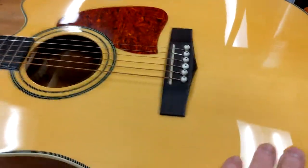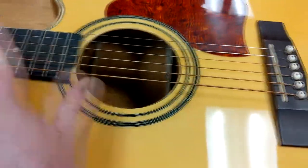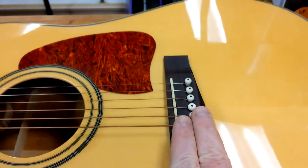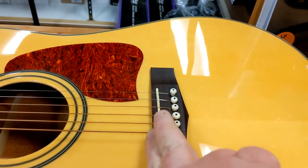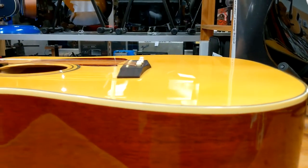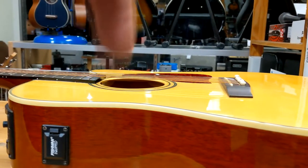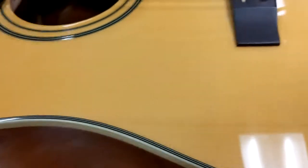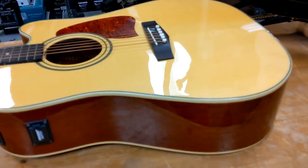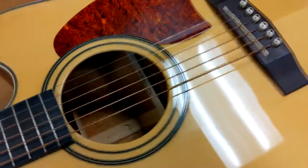So we're going to talk about top distortion. There's that hole I was talking about — it really wants to pull itself into the hole. What happens is you get bridge rotation; the bridge rotates this way a little bit. That often makes a belly on this side and a dip on this side around the hole. A lot is done to reinforce the hole; there's usually some extra bracing in here. No one wants their guitar to fail because of warranty and reputation issues, but these things happen.